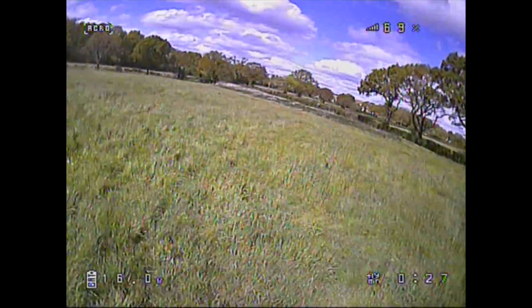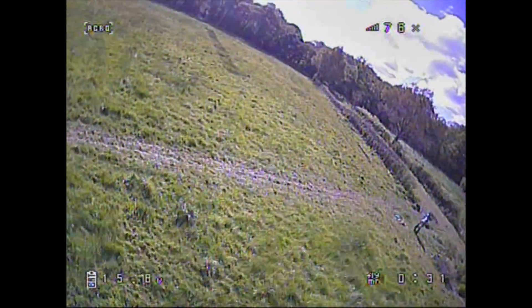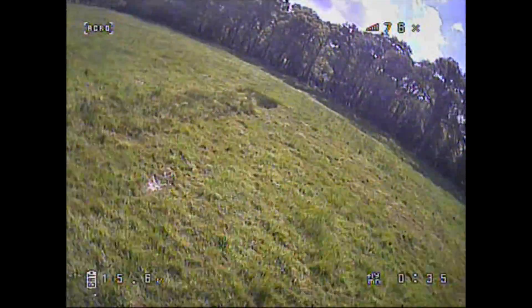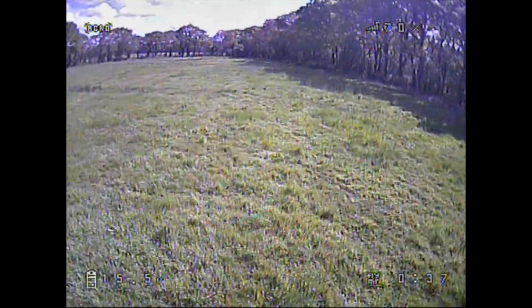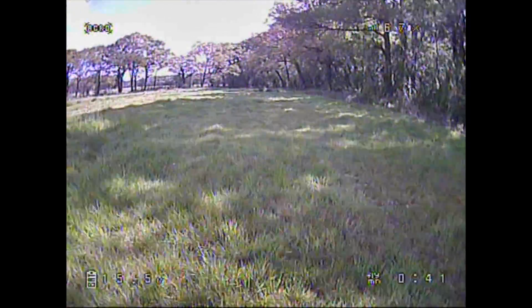But certainly it's coming through to this FPV camera quite nastily as you can see. However, looking to judge the VTX as a VTX in the picture it puts back, it's absolutely all OK. This is running in 200 milliwatts and I went in a couple of fields out to about 250, 300 meters.